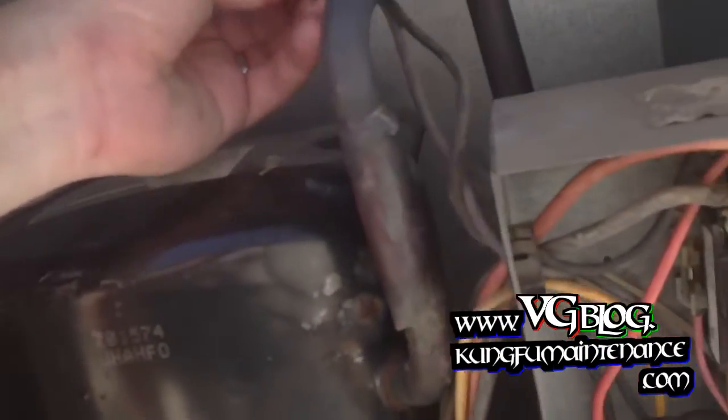I'm going to trace this back — it has some bullet crimped wiring, whereas usually these are wire-nutted together. I just want to verify that we have all connections. We have this blue wire here going to the common side of the capacitor. Not too bad. I put a new capacitor here already, so it will make changing this out a little easier.